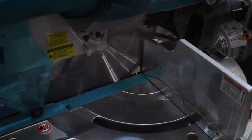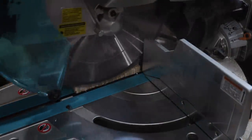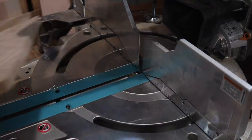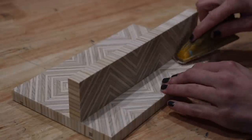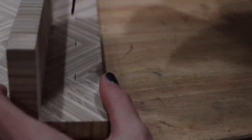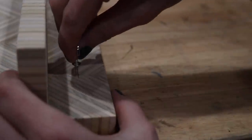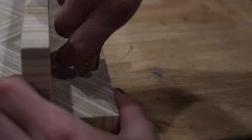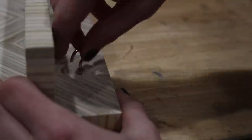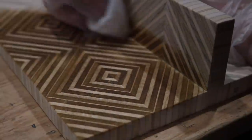Once it was dry, I brought the entire piece over to my miter saw to square and clean up the edges. This honestly freaked me out so much — I thought I was going to break it but it held up like an absolute champ. Once it was cut down to its final size, I gave it a really nice light hand sanding. Next it was time to measure and mark where I wanted to put the hooks. I decided to put them really close to the seams because I loved how symmetrical that looked, and once I was happy with the placement, I pre-drilled all of the holes for the hooks and dry-fit them. Since I was happy with the fit, I then removed the hooks from the actual key ring and finished the entire piece. I really wanted the plywood to pop, so I decided to go with a medium walnut danish oil for the finish and I feel like it was an awesome choice.